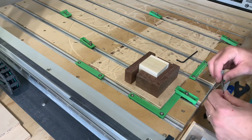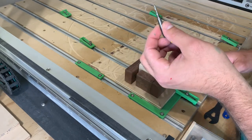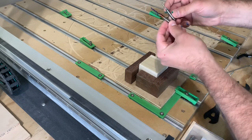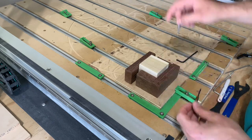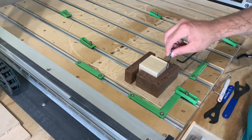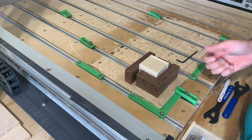All of these carves are going to be using this eighth inch downcut bit. I do have two of these bits but I need to use the short one. The longer one — that little half inch of difference means my Z height won't retract high enough no matter how high my machine is, so it'll always be hitting. I'm going to use my shorter one and carve out the letters. Hope this works.